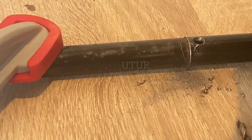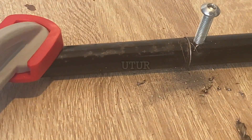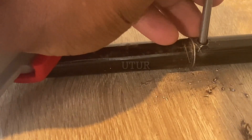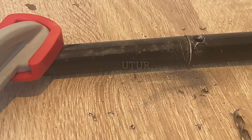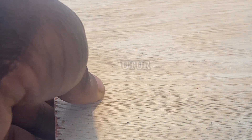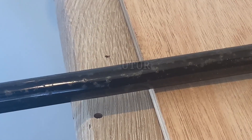Here you will see that the 6mm bolt or screw will bolt through both connecting rods seamlessly. Now that we have successfully bored through one side of the connecting piece, we will center punch the other end so that the drill bit can bite through relatively more easily. There are two ways of burrowing through the underlying side: you can flip it over and drill through the other side, or place a scrap wood piece underneath the connecting piece and drill right through — this will help prevent drilling through the workbench or table.